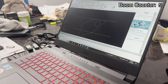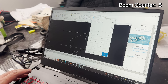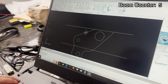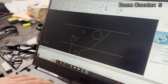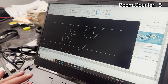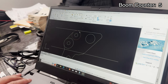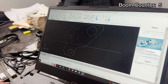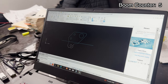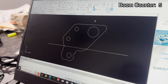Coming back to the screen, we are going to put a hole in here — we're going to do 8 millimeters, so it's like 0.320 in inches — oversized a little bit so the bolt doesn't get stuck. We're going to paste it somewhere around here, delete the excess, and do some tangent circles. We're going to round this back edge out so it doesn't look so wonky — put a quarter-inch radius, trim off all the excess. For those of you wondering, we're using DraftSight CAD. It's from kind of the same guys that make SolidWorks — it's like 80 bucks for a whole year. Super legit. We use it all day for water jetting.